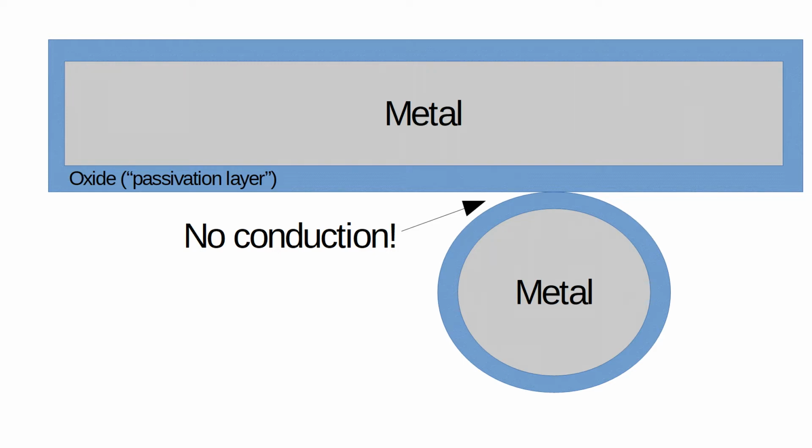Aluminum doesn't rust because aluminum oxide is really hard. A layer of aluminum oxide forms that's a few atoms thick, and then the deeper metal is shielded. Iron oxide, on the other hand, is soft and kind of flakes off on its own, so iron just rusts into oblivion over time. Gold is actually one of the only metals that won't oxidize on contact with air, which is why you see it used on contacts so much. But you can't use it in switches because it's so soft it just scrapes away pretty quick.